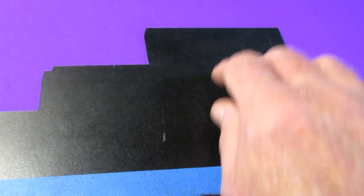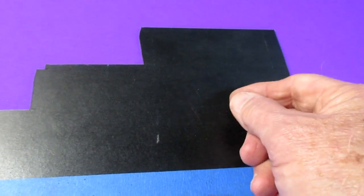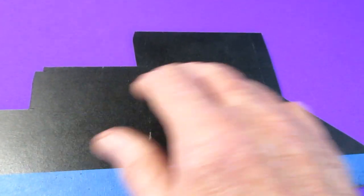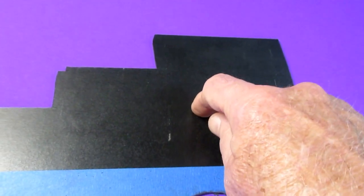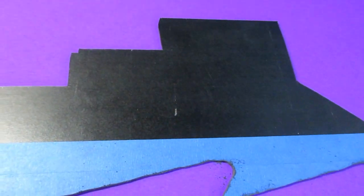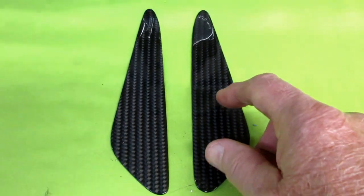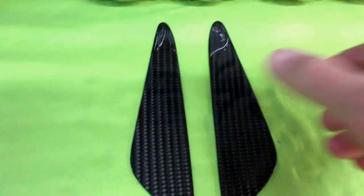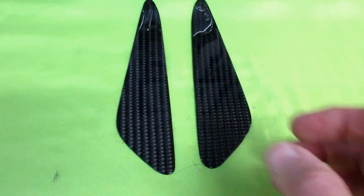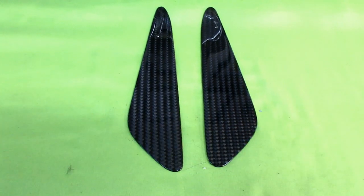If you're going to paint the part, you want to make sure there's not a single fisheye anywhere. Prime it, reprime it, sand it, whatever you have to do - because once you have a fisheye in there it's just going to keep coming right up through the clear. These parts with a bright shiny finish are very attractive but they're not anywhere near as strong - if we were going to use this to hold the back wheel on, this would not be the material of choice. It's always good to know ahead of time when working with carbon fiber: are we trying to make it pretty or structural? For right now we want to get a nice finish on that solid carbon material.